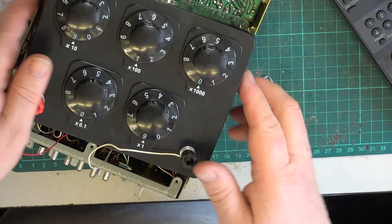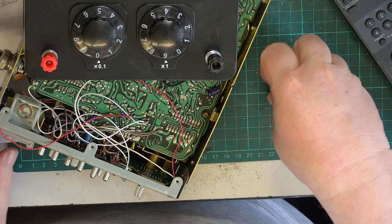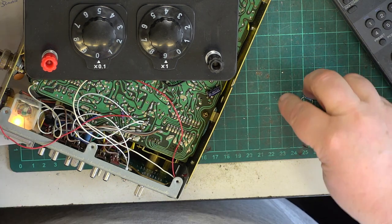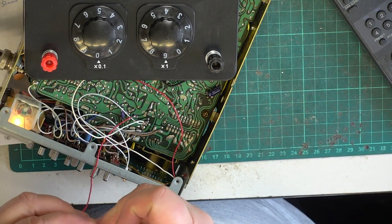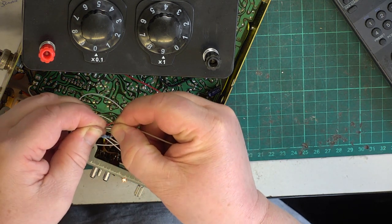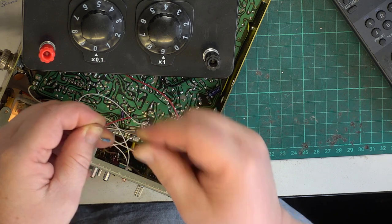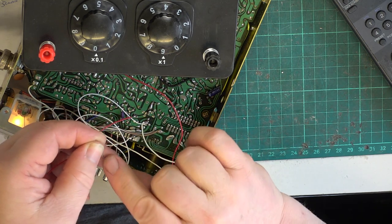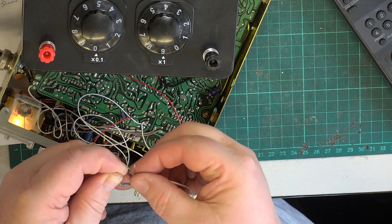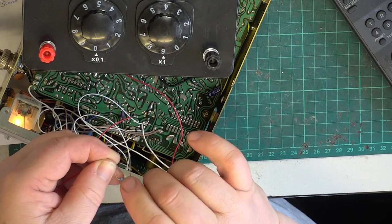across. I'll disconnect that. We'll switch the set back on. There it is, really dim. Just hold it across that. And that is exactly the brightness we want. And this won't get stupidly hot because the existing resistor, which is 1 watt, is still actually doing most of the work. This is only doing a third of the work, and it's 0.6 watt rated.